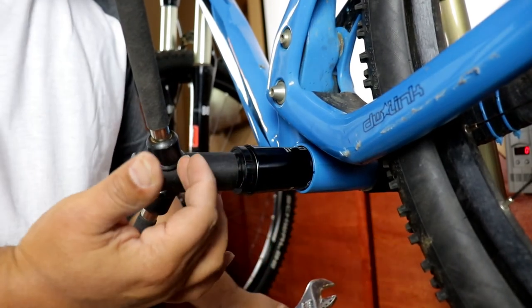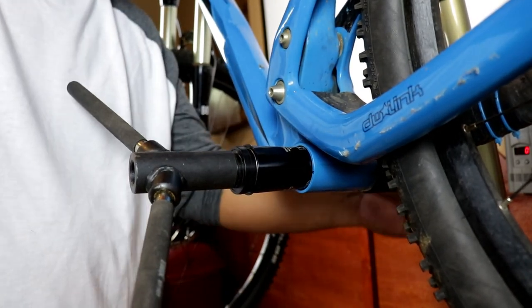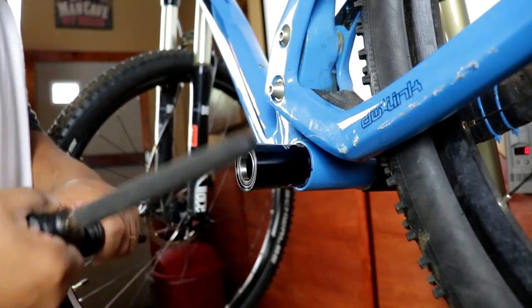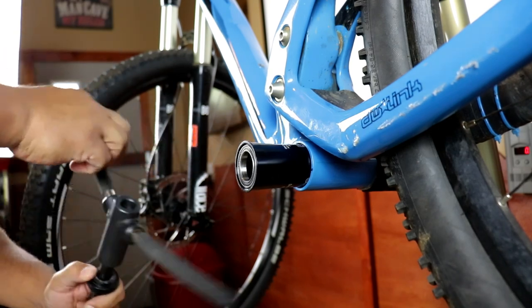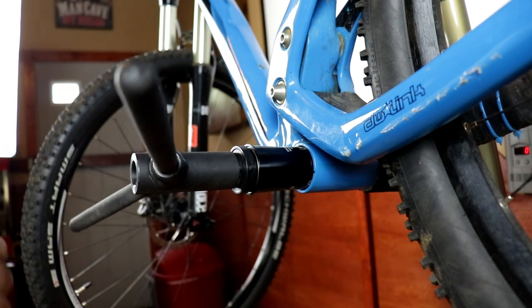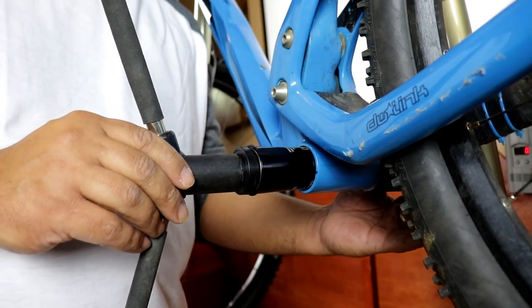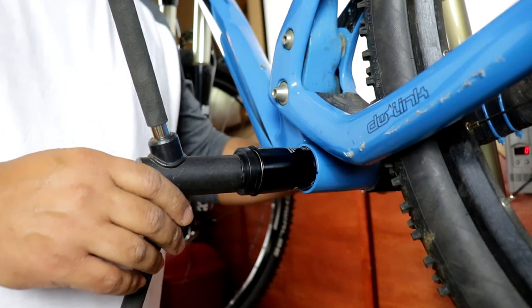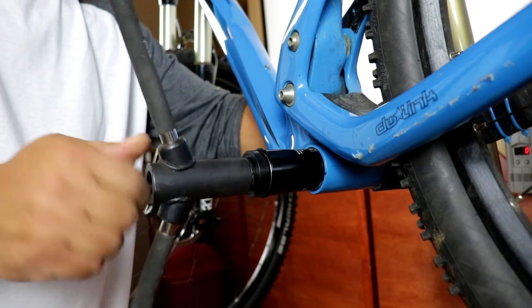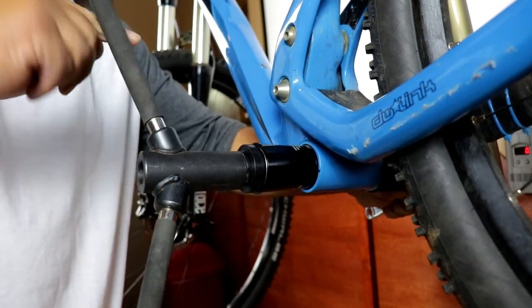I've reached the end of the threaded portion of the install, so what I'm going to do is unlock the back nut here, take the locking mechanism off, and back this out. I'll unscrew the rest all the way back to the top, put this all the way back through to make sure it's secured and riding nice and level on the bottom bracket. Then take the locking nut for the press tool, put it back on, and move it as far as it will go until it's locked. Put the wrench back on where I had it before and start the process all over again — this is just a rinse and repeat.